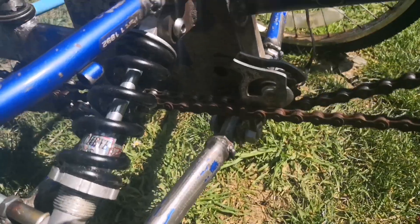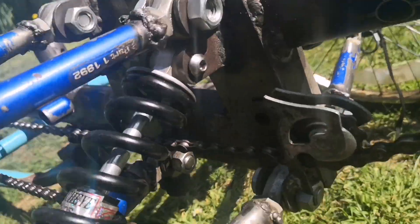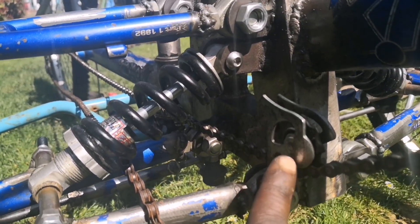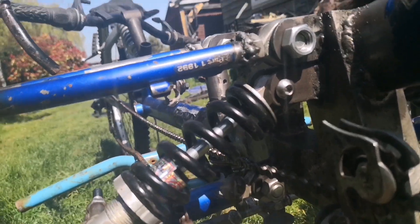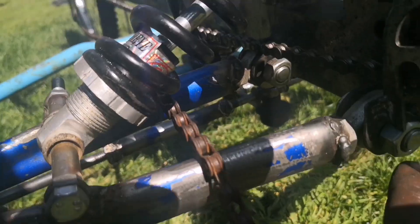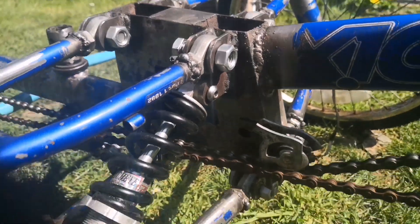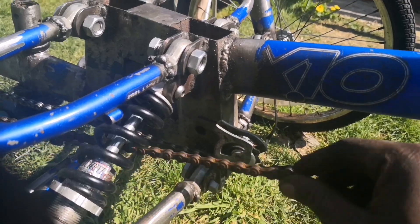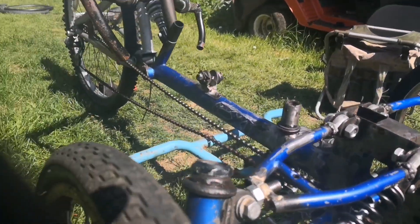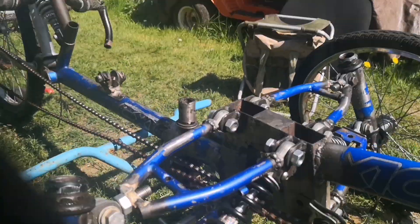So that's the front chain guide — it's a bracket to hold the main chain. I took a rear derailleur, chopped it in half, and fabricated a bracket so that it more or less bolts onto the existing bolt for my suspension. All I'm left to do is find the tube for this other chain. The chain is basically about four different chains from different bikes, all linked up.